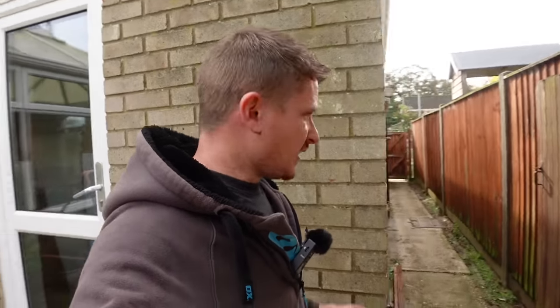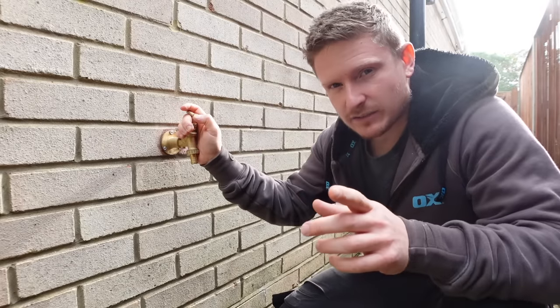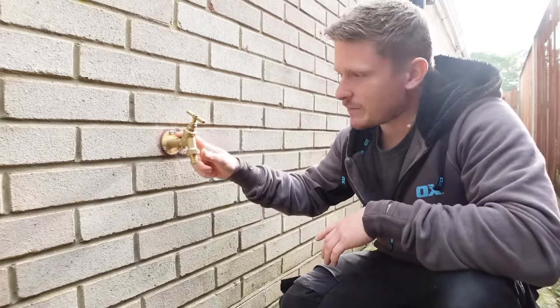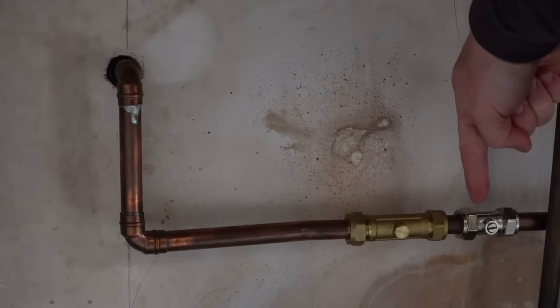So we've looked at the heating system and we're confident it's working properly. Now what do we need to look at on the exterior of the home? The first thing is outside taps — how can we prevent them from freezing? If the pipes or fittings freeze, they can split the pipe, causing a leak which is inconvenient and potentially expensive. You can see where the pipe for the outside tap passes through the wall — the cold supply comes in and passes through an isolation valve. The first thing you need to do is turn the isolation valve so no water can be supplied to the tap.